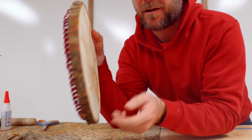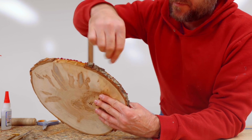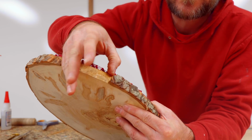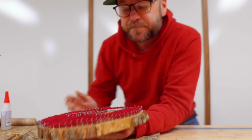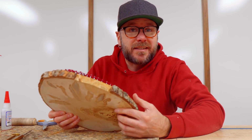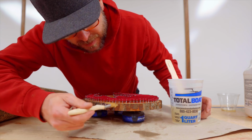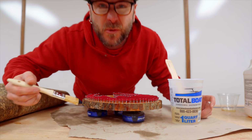Put a little bit of hanging hardware on the back. I got some bark on here, so I think I'm gonna brush on some epoxy just so that doesn't flake away, because as you can see, you don't want that. So you can either remove the bark and have that edge, or epoxy that bark. This is epoxy from Total Boat. This is not sponsored, but it's just what I happen to have on hand, and it always works.